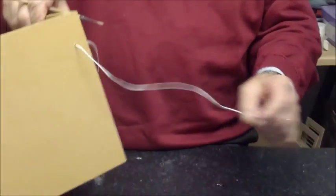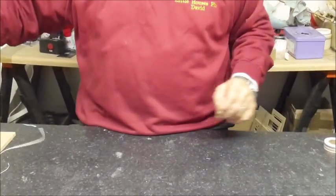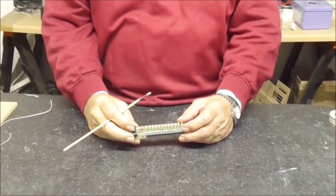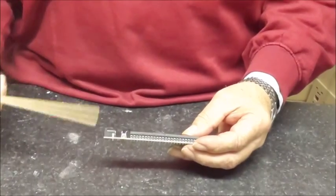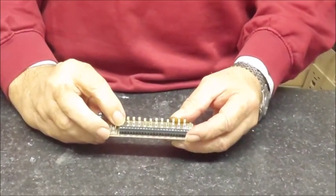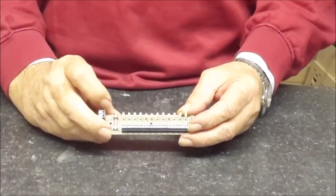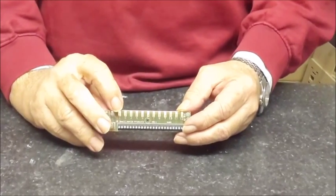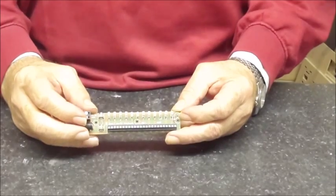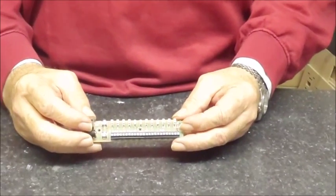This will give you some wires hanging out the back of the house, but you can then attach them to an SW04. When you put the wires into the SW04 here and some little screws, tighten them up so it holds it nice and firmly. The little switches here move up and down, and that will enable you to turn your lights on and off individually on each particular run.